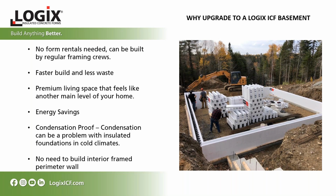Premium living space that feels like another main level of your home, and that's because it's super insulated and airtight. So you create a very energy efficient wall system with Logix. Condensation proof. Condensation can be a problem with insulated foundations in cold climates if it's not done properly. With ICFs, you don't have that issue. And there's no need to build interior frame perimeter walls. With Logix ICF, you can just stick the drywall right onto the ICF without having to frame in front of it. So those are some of the benefits of using ICFs.